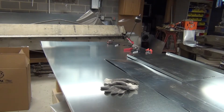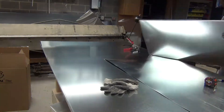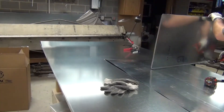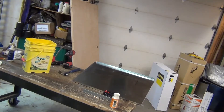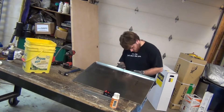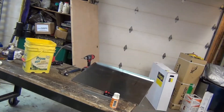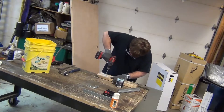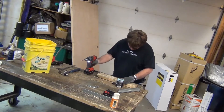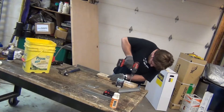It is made out of 24 gauge galvanized sheet metal and has three flanges: two on the sides for mounting and one on the bottom to add rigidity. For mounting the panel, I drilled oversized holes to give me a lot of wiggle room. I also used a caliper to mark out the holes, mainly because it is easier to hold than a tape measure. When I drilled the holes, I used a block of wood underneath the metal — this gives a cleaner hole because the drill isn't ramming through the steel.